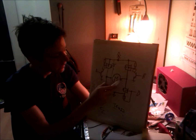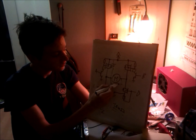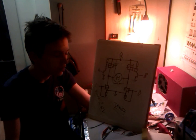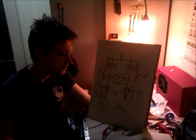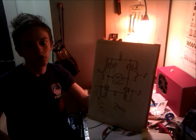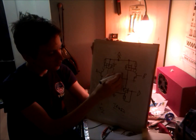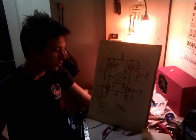Also, because of the EMF, it's recommended to add some capacitor there, so once the opposite charge happens, this capacitor acts as a discharge, neutralizing this charge too, because it reacts to the AC current, and capacitors do conduct AC current in some sort of way. There is a lot of talk and a lot of dust about this EMF. So basically the most reliable methods are some Schottky diodes and of course capacitance, but you should also know that this capacitor is going to make the response a bit slower if it's too big.